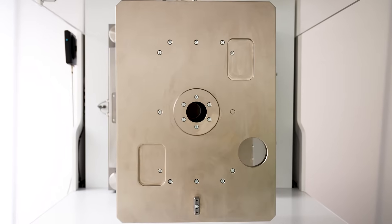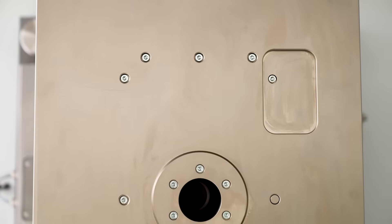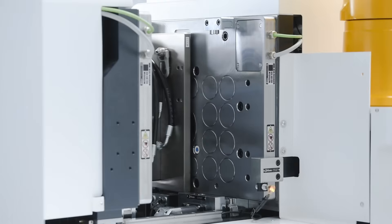The mold backplate is also a critical piece in creating the magnetic circuit. The surface must be clean on the backplates. It must be flat. The thickness has to be ample in order to get the maximum holding force required. So there's more to it than just the magnetic clamp plates themselves — the mold backplate is an essential piece of that circuit.